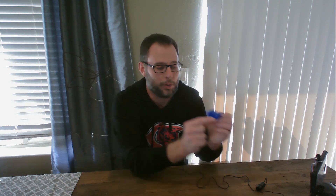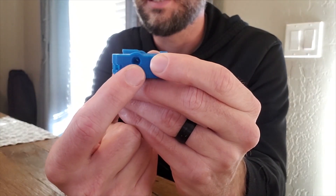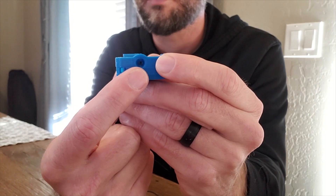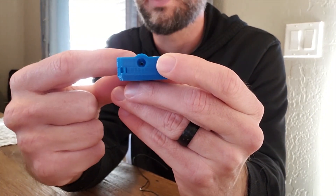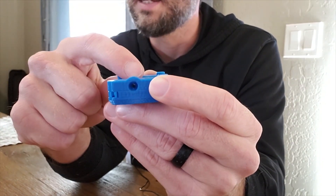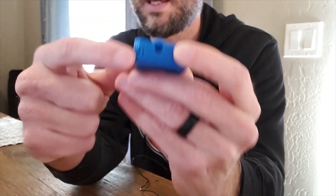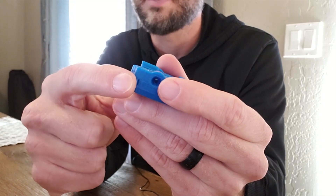This is a 90 degree angle where it's at here, so it still puts support in here, but in the holes it didn't need it anymore. All the way deep inside that hole it said it was going to generate support, but the supports were so small that it didn't even generate there. So I only ended up with support where I wanted it, not where I didn't want it, and it produced this perfectly. I can cut these supports out really easily and get it exactly the way I wanted it — I was worried about them being too hard to get out of that hole, but now I don't have to worry about it.